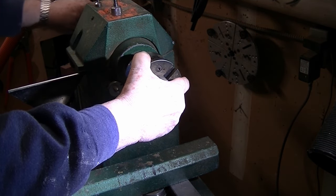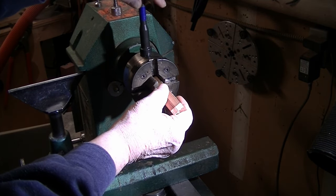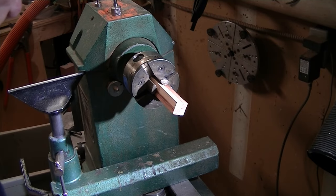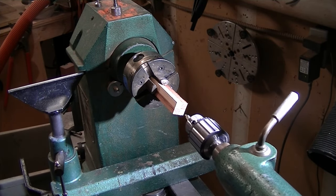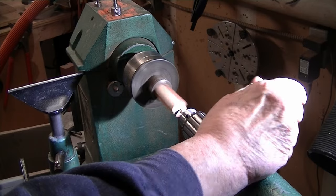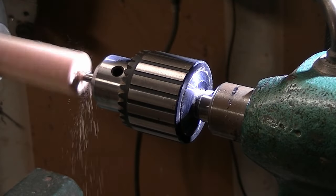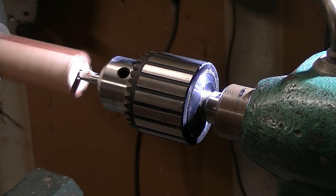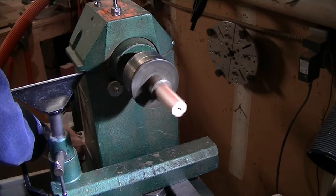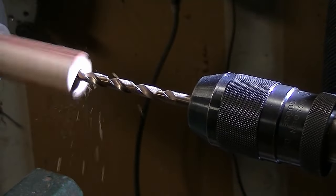When I drill, I like to do it on the lathe. I have components that line up perfectly, and I'll use my four-jaw chuck to hold that billet of wood as square as I can. I'm going to use the tailstock Jacobs chuck and drill bit combination to get it as centered as I can. I will start with a center drill — this is something that is short and stubby, and will put the hole dead in the center without wobbling. Once that pilot is created on a billet, I take that bit out and substitute the standard seven millimeter drill bit, which when driven in will go dead into the center and create a perfectly aligned drill hole.